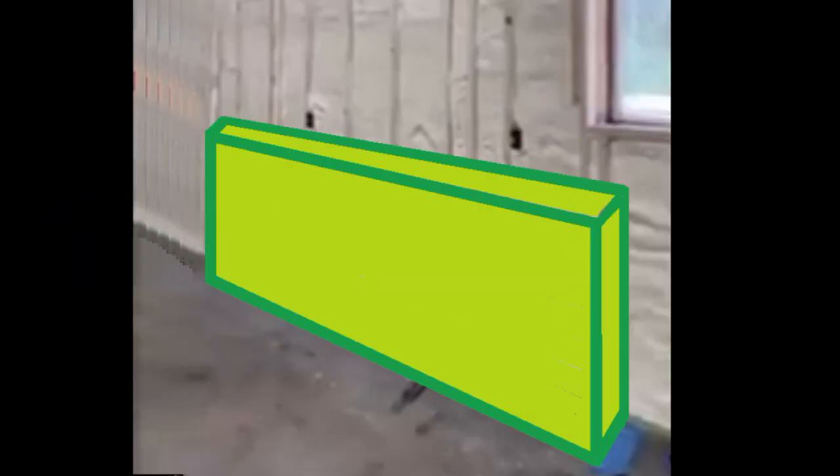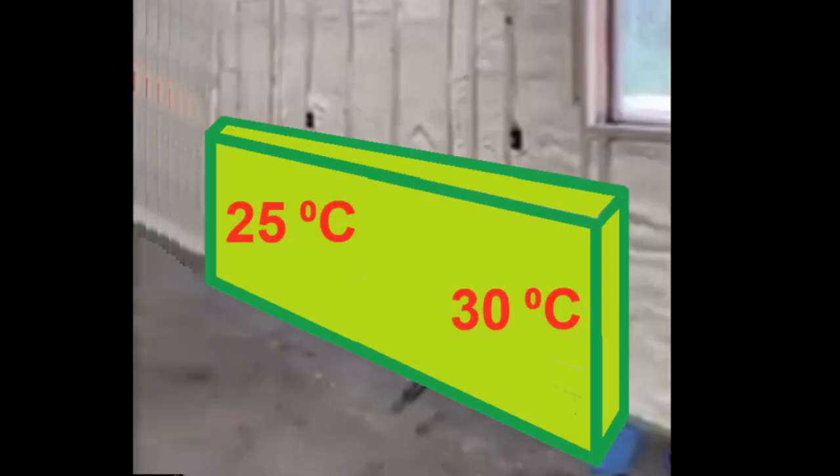This was the first mode, which is to be used in November and March when 30 square meters of that black wall have to simultaneously heat the room during the daytime and increase the temperature of 1 ton of water in those bottles to 25 or 30 degrees at about 3 o'clock in the afternoon.